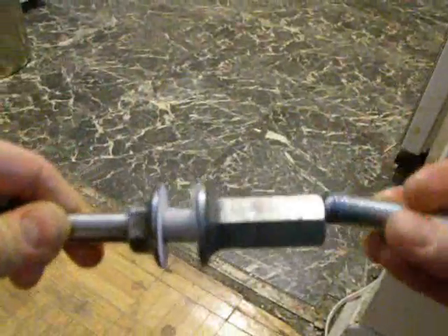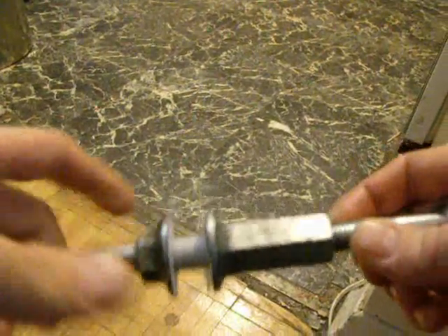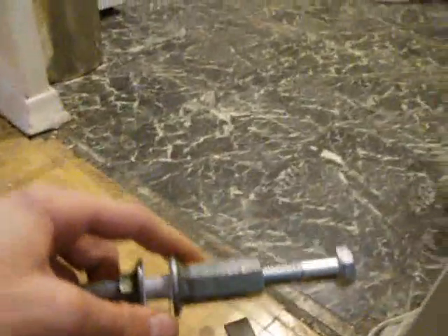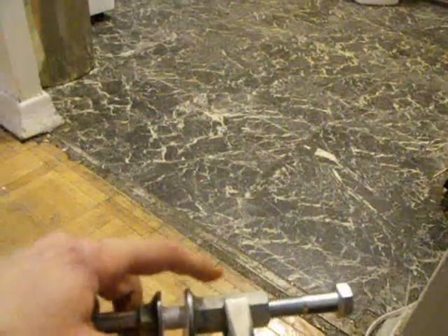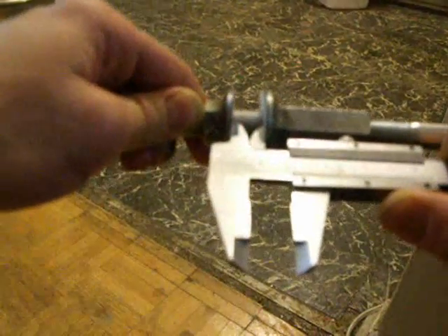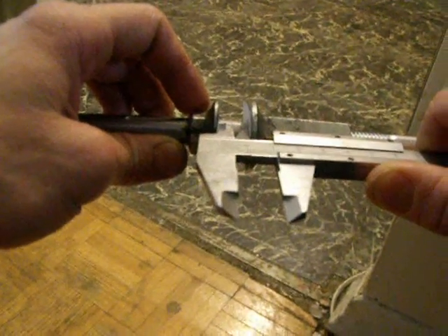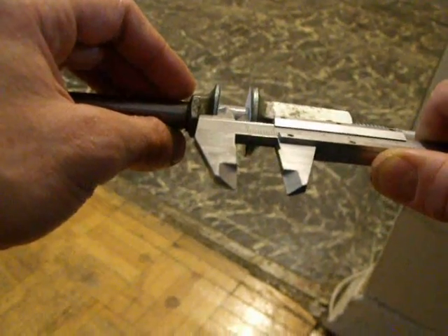So bad I don't have 3 hands — 3 hands will be helpful. Then I want to make sure the screw is jammed so the whole construction will not disassemble when I will be winding the coil. After it is adjusted and fastened, I want to make sure the gap is precisely 14mm — I'm gonna check it again. 14.1mm. Well, good.